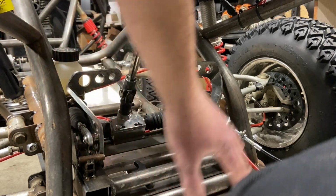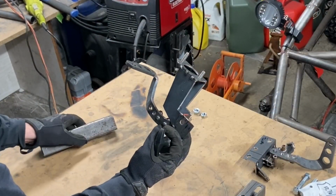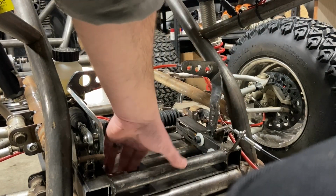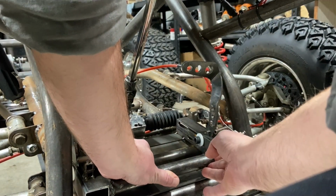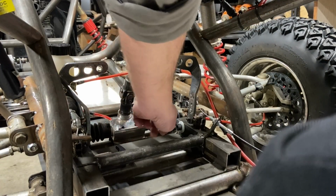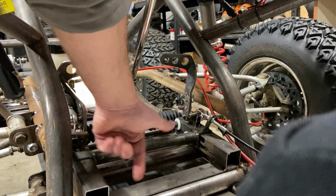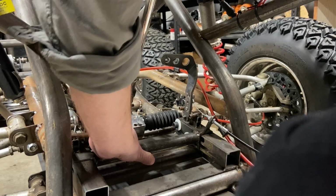And this is what we did. Now it's probably hard to see because everything is just metal colored in here, but I've got a brake, I've got the gas pedal. Now I hooked the master cylinder to a bracket I made for the brake pedal, and I hooked the throttle connection to something that also slides with it. Now this piece is a spring-loaded pin. I used it for the doors on the race cart. And all you do is pull that pin, and there are two slides with bolts in them with nylon washers because it's sliding. And all I did was cut holes every inch and a half or so so that there are multiple positions and that pin just locks into them.